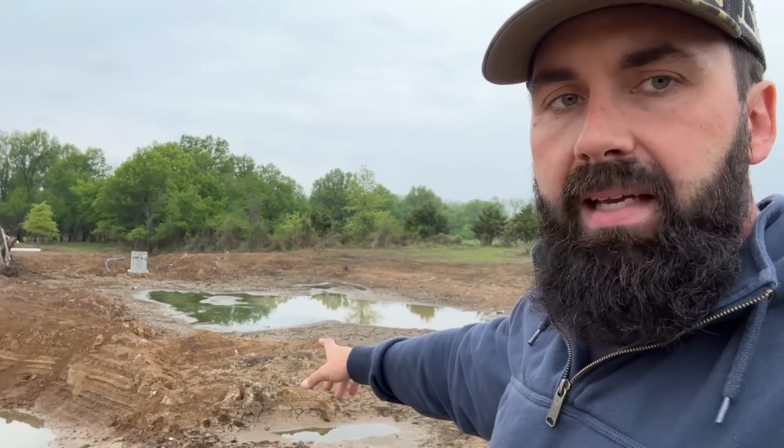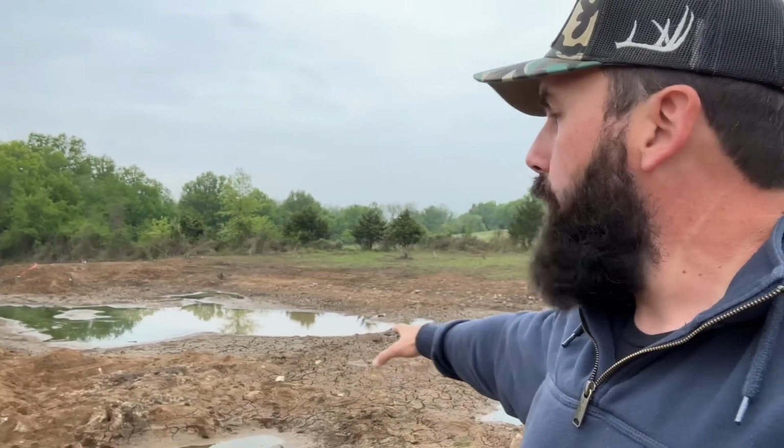And if you're in a room for framing out a cabin, you can sit the laser in the middle, and as long as it's level, it's got a leveling bubble on top, it shows you, like, say you wanted to run a beadboard with a chair rail. That would project a laser around the room in a perfect square at like 4 feet height, or whatever height you wanted for that matter. Somebody said we should actually, and I like the idea, we can get a laser and put it on these mounds. The reason I say DeWalt's is because I've got tons of DeWalt batteries and it's battery powered, and it'll throw a green laser.